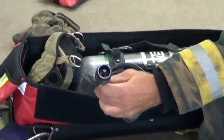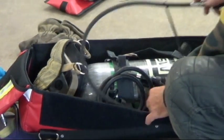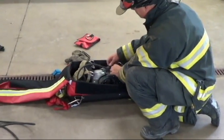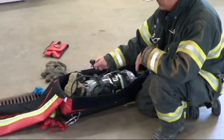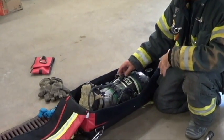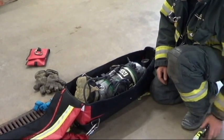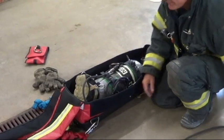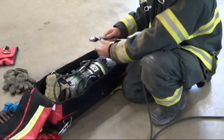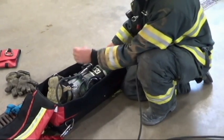Here is the three-foot quick-fill transfer line that's pre-attached to the first stage regulator. Run this to the second snap — the one by the handle — and clip it in place. Keep the dust cover in position and tuck it out of the way. This leaves the connection and port available for the 25-foot line. The best way to connect the 25-foot is to have one of your partners run the line completely all the way out. Here's the male end — it simulates the same fitting that's on your SCBA. Pre-connect it up.